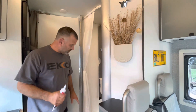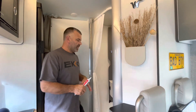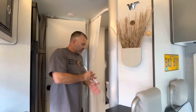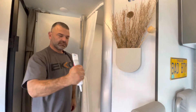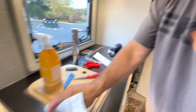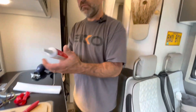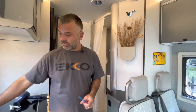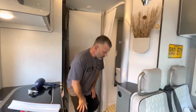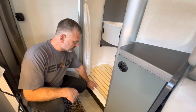The reason I like using this small squeeze tube versus a caulking gun tube: imagine resetting a toilet or sink in tight areas with a caulking gun and a lot of obstacles to contend with. With these little guys you hand-squeeze them - very easy to manipulate, get into tight corners, and clean up edges nicely. Tools summary: exacto knife or equivalent, simple ballpoint pen, cleaner or denatured alcohol. You can also scuff the area with sandpaper - we chose not to, as it made a good bite anyway.